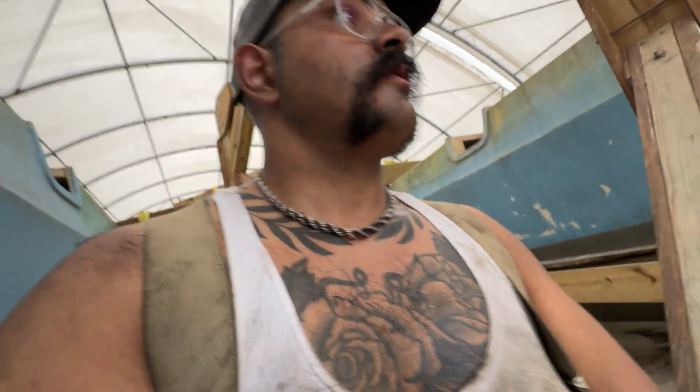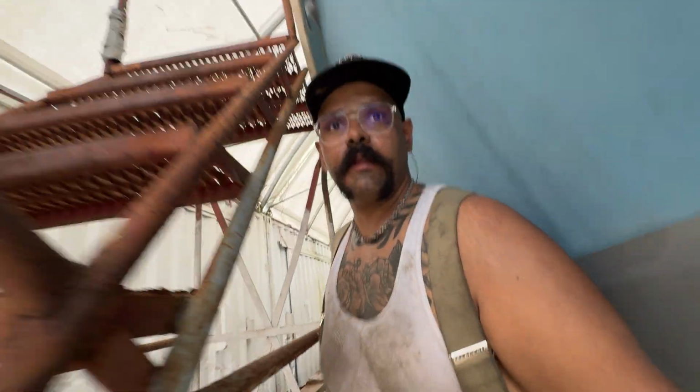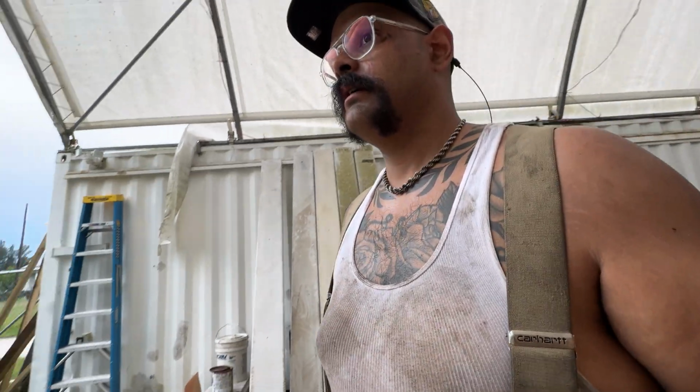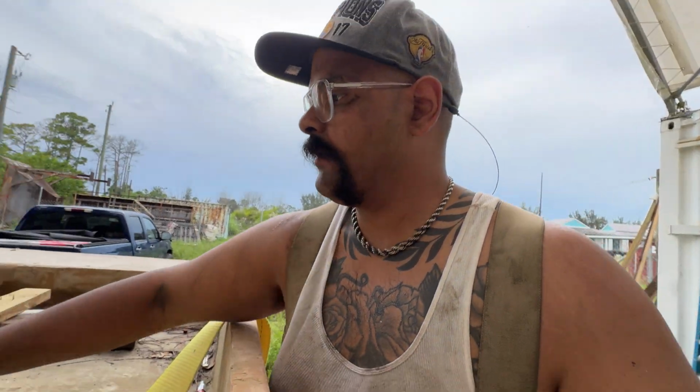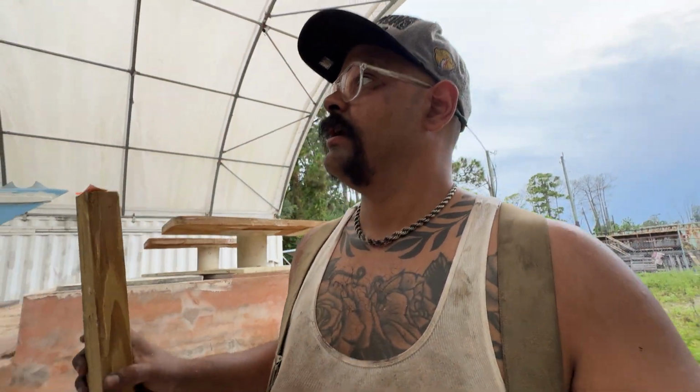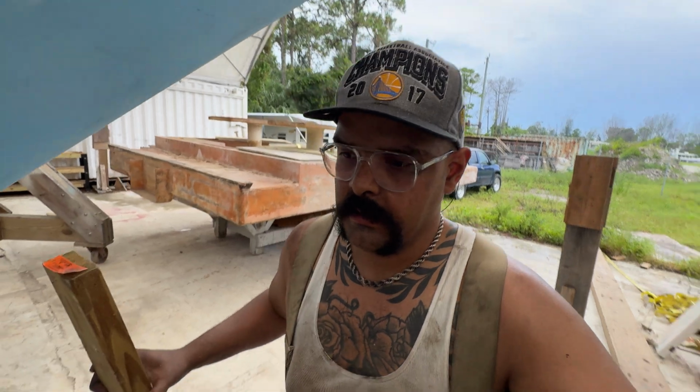Okay, so unfortunately, as much as I wanted my plan to go to plan, it's not, because the beam is getting stuck. So what I'm going to do is, on the right side beam that's already been lifted, I'm going to wedge a piece of wood, and hopefully that piece of wood keeps it in place so that when we come to drop the other side, once we loosen tension, that side will lift up, hopefully. We'll see.